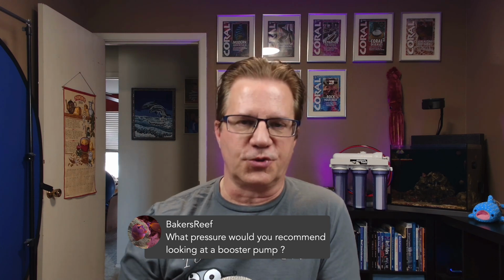But you're right. What pressure would you recommend looking at for a booster pump? Basically, a booster pump doesn't let you dial into a certain speed. They're set and forget. You just plug them in, and they just do their job. But normally, it will add 40 psi to your system. So if your system without a booster pump is running at 30, then with a booster pump, it should take you to 70. And if you're ever wondering if your booster pump is doing its job and you have a PSI gauge on your RODI system, you can turn it on, let it run, and then unplug the booster pump and watch the needle jump, and you can see, okay, I'm getting an extra 20, or 30, or 40 PSI.